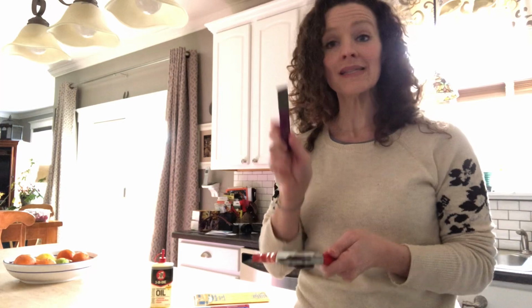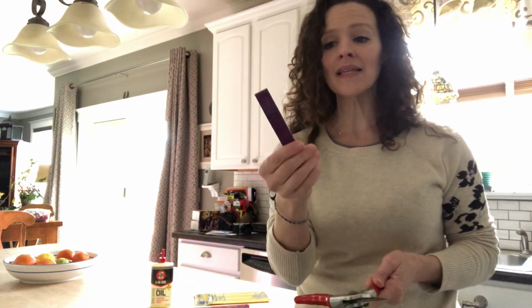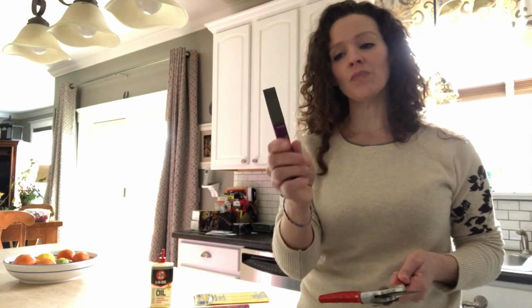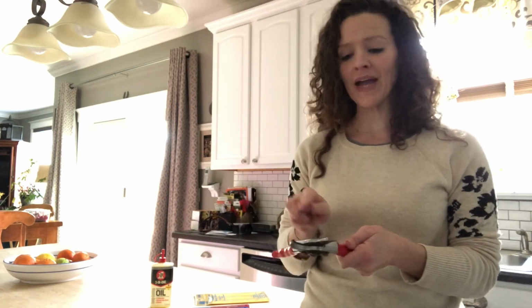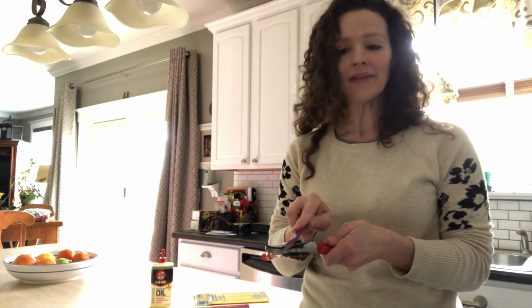So, but you want to make sure you're going with the direction of the blade, the slant of the blade. So I've got this medium grit. And I really like this because they're only about 6 inches long and they fit perfectly in your hand. So they're a plastic handle with the diamond grit pad on the end of it. So I'm going to make several passes until I feel like it's enough. So I'll just keep going.